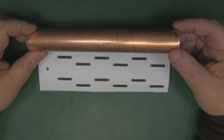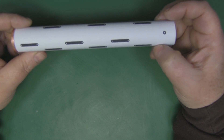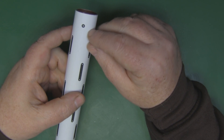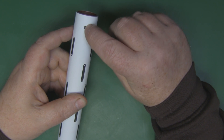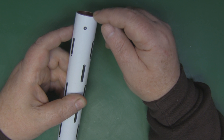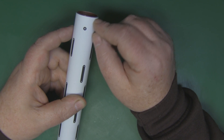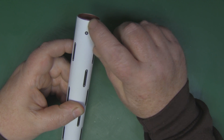If you find tubing that's 30 millimeters diameter, the template should fit quite nicely around that as well. Here's the template stuck to the tubing. There's a crucial point when applying it: the template is just slightly less than 200 millimeters, so there's a slight gap at the top. The hole we're going to drill is just slightly over a quarter wavelength at 5.8 gigahertz, so it must be lined up exactly with the edge of the tubing. Make sure your template is aligned with the bottom edge of the tube — that measurement from the hole to the bottom end is quite crucial.